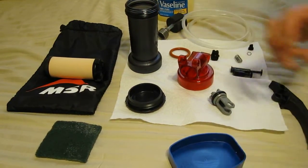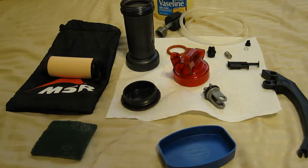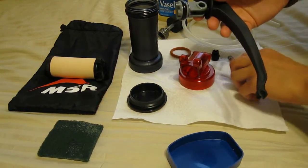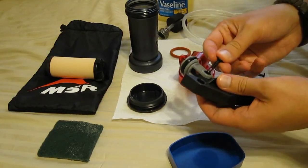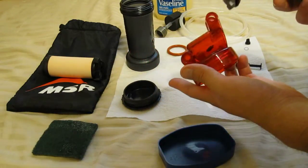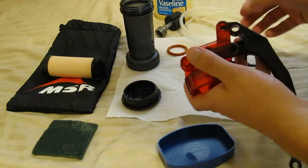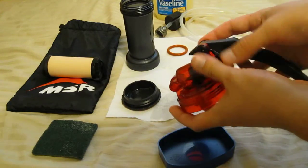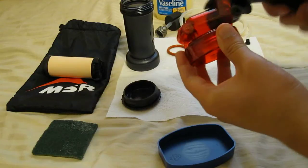So that's pretty much your three O-rings that are going to need to be lubricated — a very simple process. Now for how this whole thing goes back together: we have our piston and our handle body. This will go into here. There is a small capture pin that slides through this assembly and allows it to pivot. Put the other side in — and there's your piston assembly. This goes into the upper housing — it is directional, so you've got to make sure you get it right. Take the other capture pin, stick that right there, push it through, and we now have a properly lubricated and functioning pump handle with no squeaking.